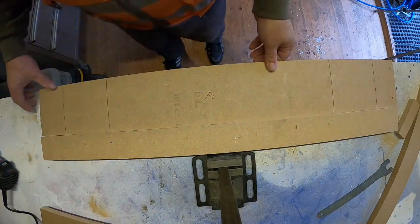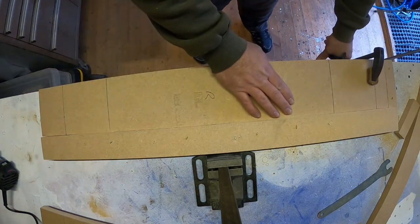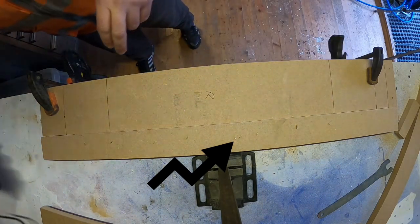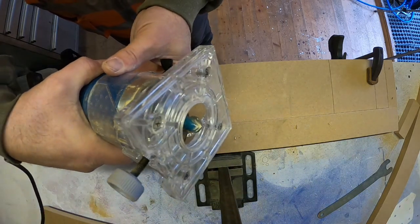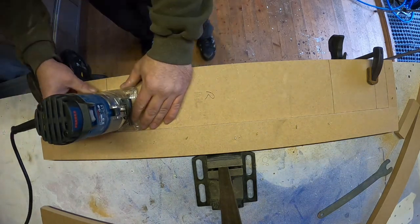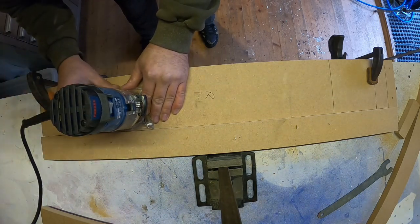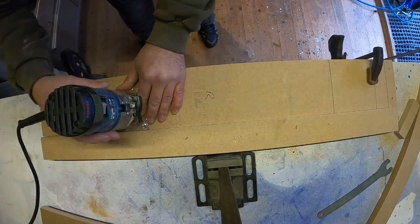What I'm doing here is making a bit of a jig on the bench. I need to cut two grooves at the front of the piece, so I'm clamping the piece down both sides. The piece shown with the arrow is actually two pieces of MDF, so the router will run against that with a cove bit just to create the groove. What I should have done is put a stop block each side so the router runs up to it, instead of trying to guess up to the line — but I still managed it, just had to do a bit of tweaking.